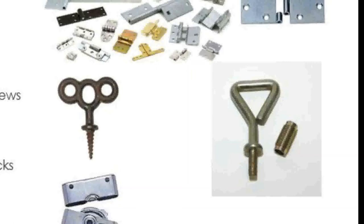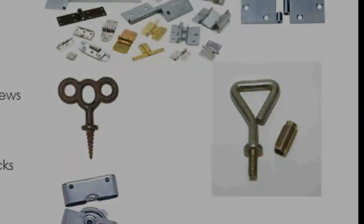It causes a lot less harm to the stage because it's a perfect circle and it holds over time. So if you've got a show running over a very long period, you want to use something like this so you can continually use it over the entire run. With a regular screw, if you keep going into the same hole long enough, the hole will eventually no longer accept the threads and the screw won't hold. So the old stage screws don't work for extended runs like the improved stage screws do.